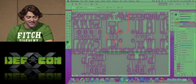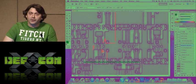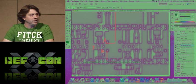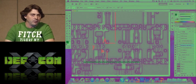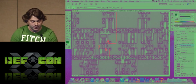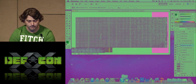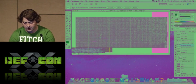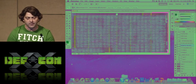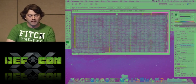You can see a lot of other gates to the right that are really functional. The pictures don't lie. That's what I always tell everybody. If you do your due diligence, you do all your polishing, the chip, it's right in front of you, whatever you need. When we first came into the chip, it looked pretty scary. Let me zoom out. So you look at the chip, and also, does everybody notice that I didn't image the whole chip? This is at 1,000 power optically, but I didn't image the whole chip. I only imaged my region of interest.